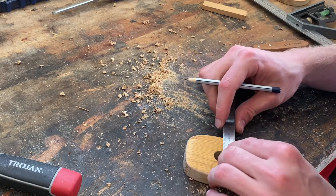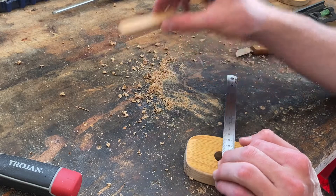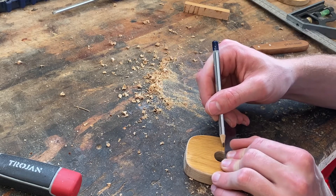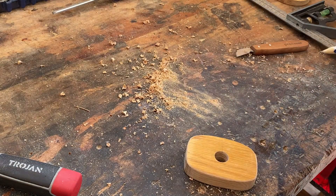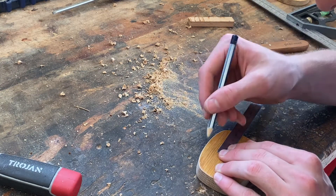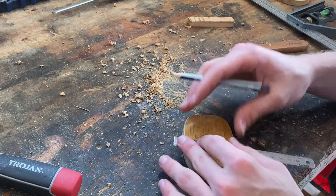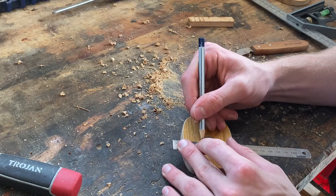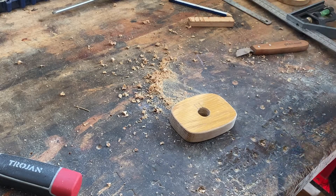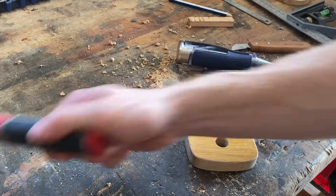The next thing is to pick one side of the circle. Since the wedge is about 15 or 16mm high, I'll take half of that and continue a line up about 8mm past the top of the circle. Since the wedge is about 8mm wide, I'll continue a rectangle 4mm either side of that line, making a rectangle. This is where a coping saw would work well, but I've got a chisel, so I'll come in with a chisel and work that out, then maybe clean it up with a file once I'm done.